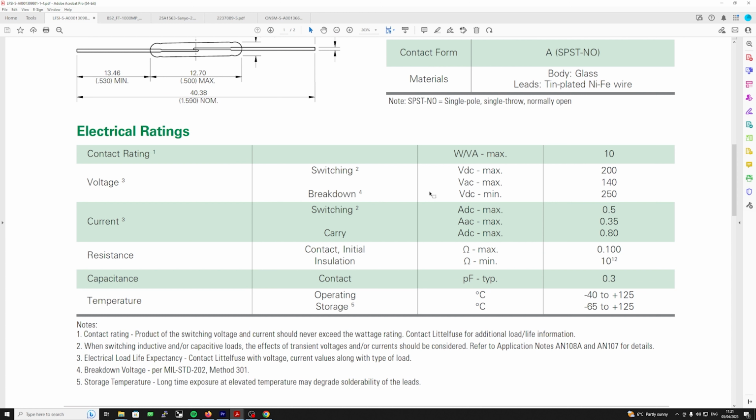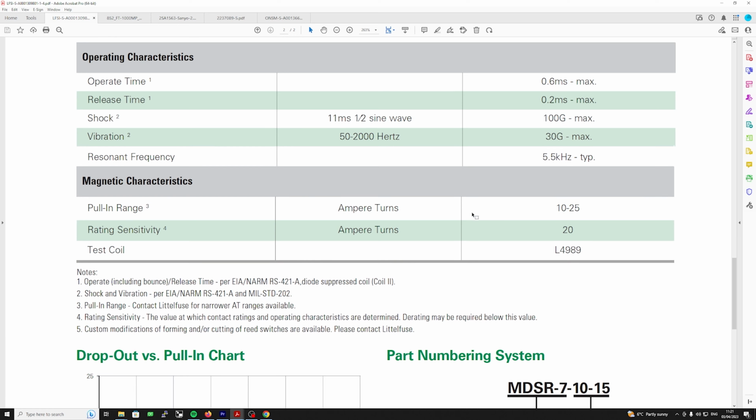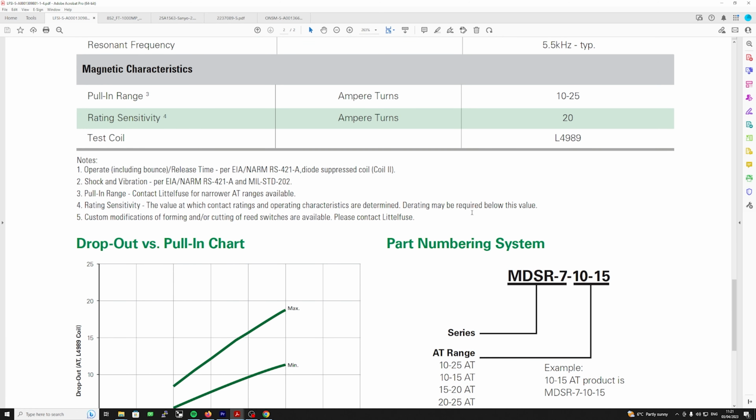Again, I don't know if this is going to hold up, but I think what's made this thing fail is that the switching transistor, I think it's just pulled it in because it's failed. And I've re-modified the circuit, which I didn't want to do, but I'd rather no current goes through this thing at all when it's in transmit.